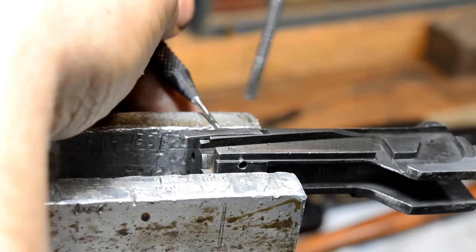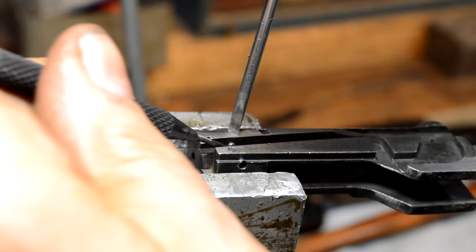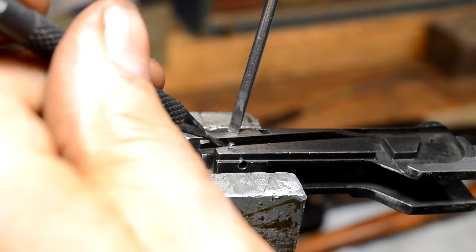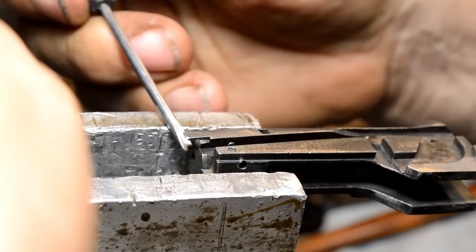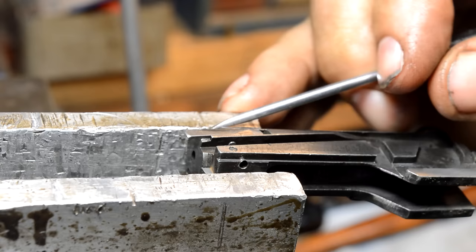Okay, when I push down on it, A5s will do this a lot, those pins that hold everything together. Now we're in. So did you see that intrude into that slot? I don't want that there. I want that to come up right flush. Right there. Flush. Bang, now we got it. Okay, now this is in, it's spring loaded, it's captured, and whatever lays in this groove can lay here and not be fouled by the end of that pin. You cannot have the pin proud of the top of the bolt, else it'll hang up on the receiver, and we don't want to do that either.